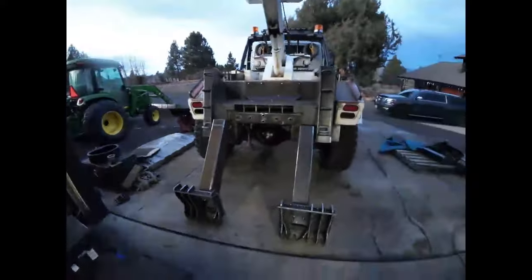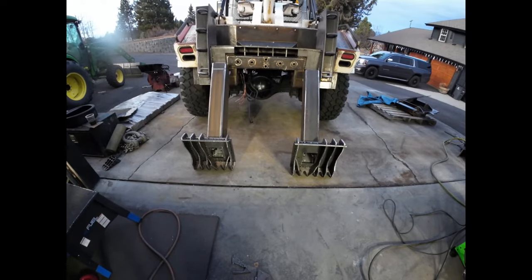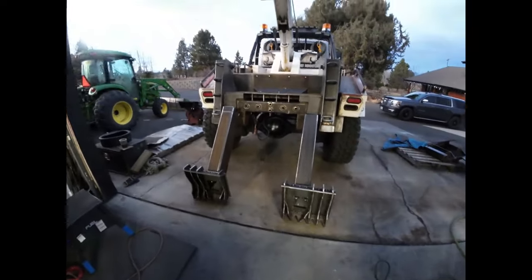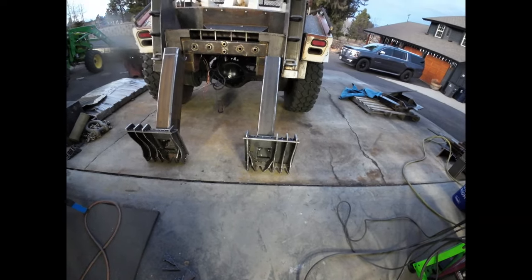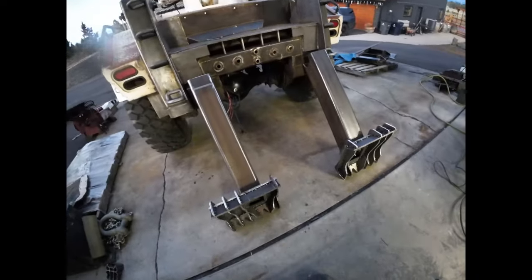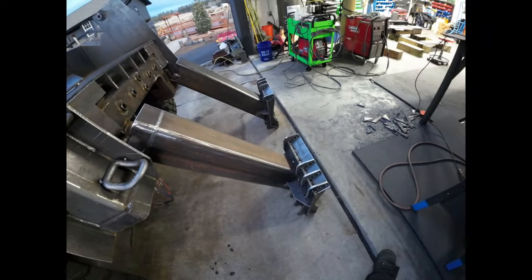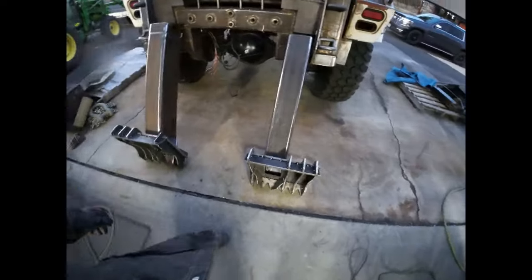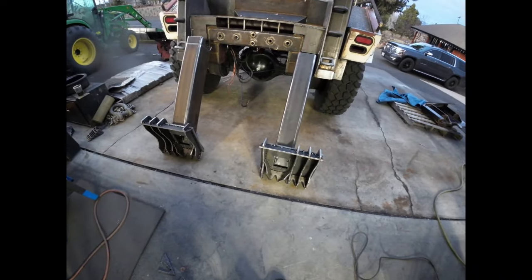Alright guys, there are the feet and the legs, and I've got a lot of welding to do. So there she is guys, both feet and the legs. I've got a lot of welding to do, and I'll do both of them at the same time, just keep bouncing back and forth so it doesn't warp or anything,